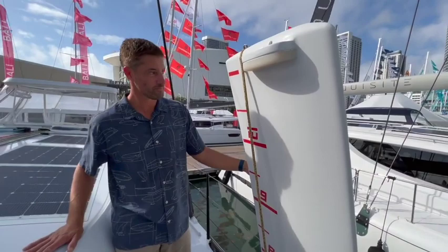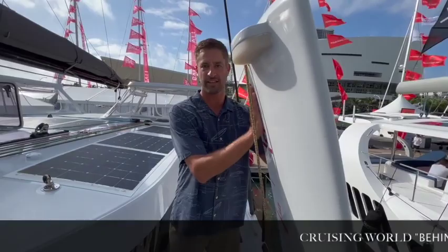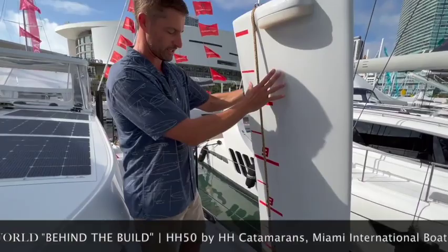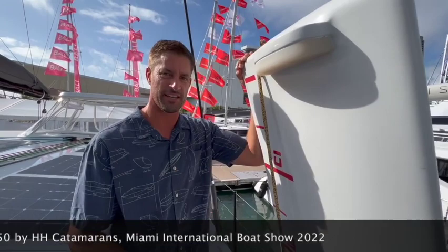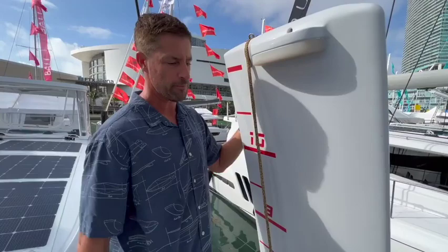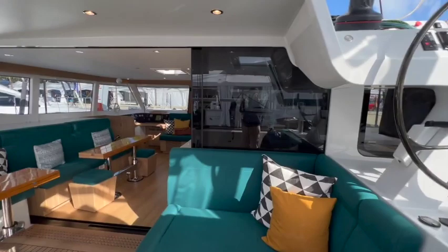This is probably the most defining and striking feature of the boat: pre-preg carbon dagger boards, built in-house. You have to bake these, and pre-preg carbon makes them as strong and as light as possible — a crucial component to the performance of this boat. They're quite long; the draft goes from about five and a half feet down to eleven and a half feet on the HH-50. That really allows owners to perform upwind — this boat will just walk upwind. They're symmetrical boards, so you can drop both or just the windward board in rough conditions. In racing, you'd ideally have the leeward board down, getting it deep into undisturbed water to keep the boat from sliding laterally.